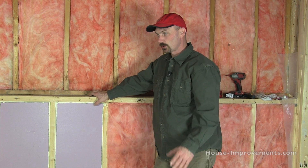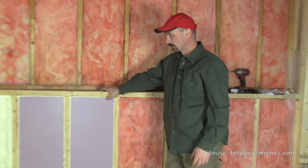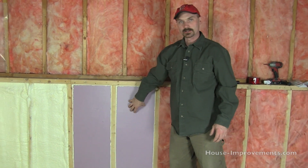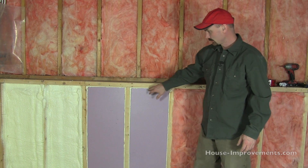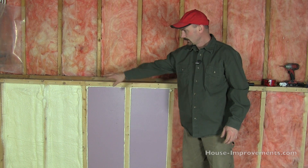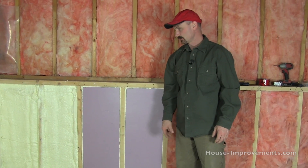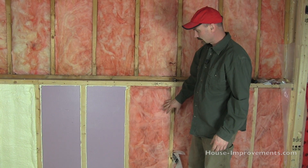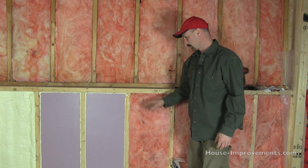It could possibly save you a step in the process of insulating by using a couple of these other options. These two over here are definitely sealed up really well. You've got your gap totally sealed with this sheet, and over there obviously the full spray foam is completely sealing that whole space. Where this one here, even with the vapor barrier over top of it, you've got some staple holes and that sort of thing where you could still get some air leakage.